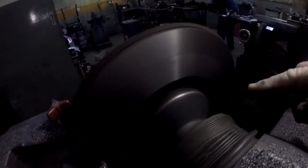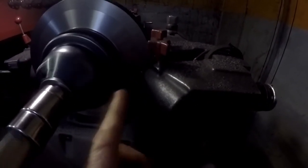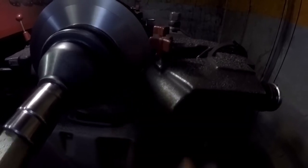You can see on this side as well — one half is shinier than the other, still cutting through. When it's done, the whole surface will be a uniform finish, which means the disc will be straight on both sides, because they are cutting both sides simultaneously. The smooth finish is obtained by making the cutting bit move much slower — it doesn't leave such a rough finish that way. You can see it reaching the end of the cut — almost done.